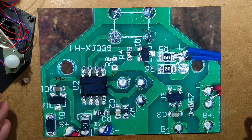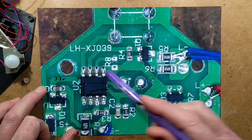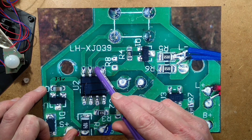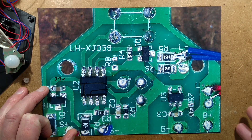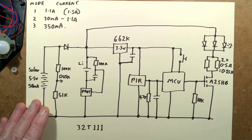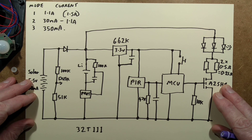There is the button just leading straight to an input. And there's a mystery resistor R8 leading to a pin, suggesting it might be for setting an option. I tried a low-value resistor across it and nothing changed, so that option is not fitted. Let's bring in this schematic — that's roughly fitting in, that's fine. The unit has three modes.